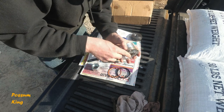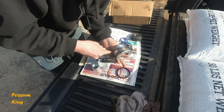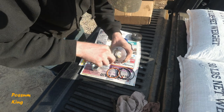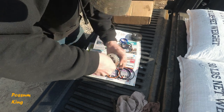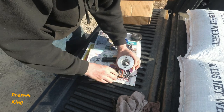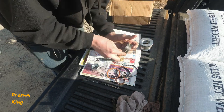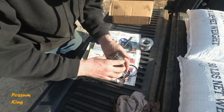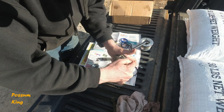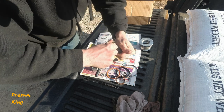And this is all the same concept of the last one, just might have it set up a bit different. Then the worst part is the actual seal itself down here. But it should be brittle enough. Oh yeah. And there it goes, that just pulls right out. All right, so we're on that case cylinder, we had V-pack stacked up in there. This works differently. This is your low pressure on this side, and then your high pressure is this one right here in the middle.